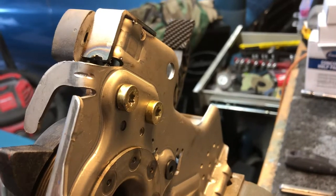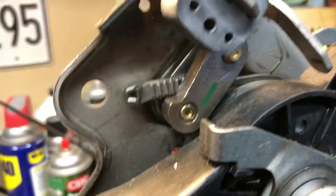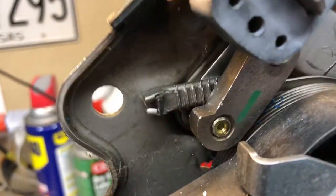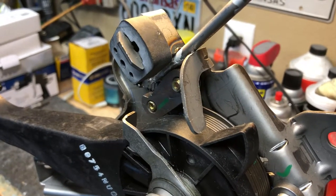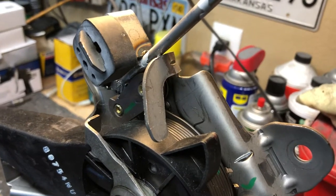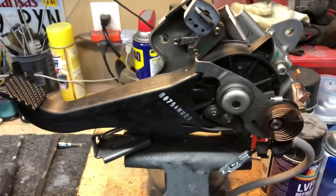On the back side there are two Torx screws — just loosen them, don't take them all the way out. If you look on this side you can see where the end of the spring just clamps onto that plate. When I started out there were only about two notches sticking out. Once you loosen it up, come around to the back side and slide your screwdriver down through here and just push that spring out. When it's loose it's not under any real tension, so you don't have to worry about it flying out. Put a little bit of tension on it, then lock those two screws back down — and that's all there is to it. You can see it's now locked in place and won't come back up.